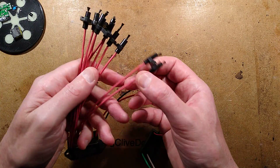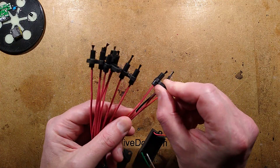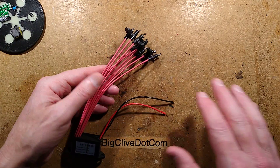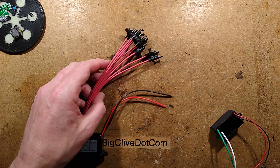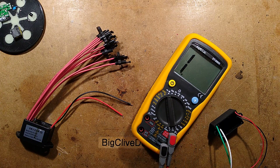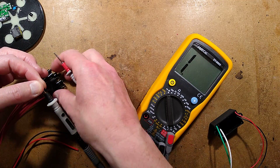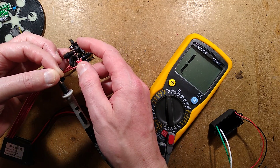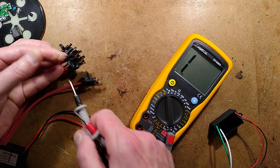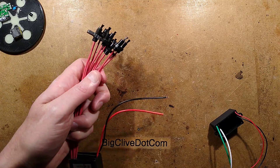I was quite intrigued by these — I actually bought it really because I wanted these little spacer things with the carbon fiber emitters, just pre-made. It was a convenient way to get them. I thought they might have been individual resistors to spread the load, but if you bring in a meter and stick it to continuity, every single one of these carbon fiber emitters — they're all just basically common together. I kind of thought: is there a reason they're in pairs, are they divided? But they're not.